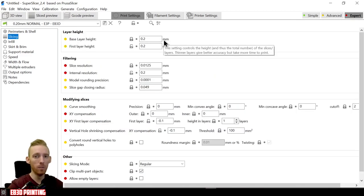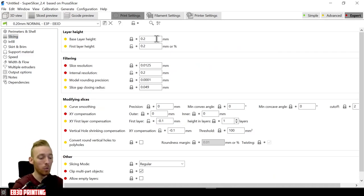The next setting is layer height — set this to a coarse value. I use 0.28. The Klipper documentation recommends 75% of your nozzle width, which for a 0.4mm nozzle would be 0.3mm. For most Ender 3 V2s, stick to the magic numbers with a step value of 0.04, so 0.28 falls roughly around 75% of the nozzle height.